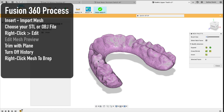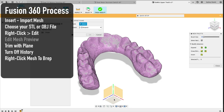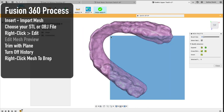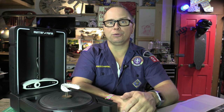Once it's a model you can do any operations you want on it. The first time I did this I brought in too much geometry, so I went back to the model in Matter and Form software, cleaned it up, took off the base, trimmed it, and got a much cleaner model with less geometry — which was a lot easier to work with in Fusion. I did some boolean operations, cleaned up the base, and removed a flat part from the bottom. You can do that inside Matter and Form software or in Fusion 360.